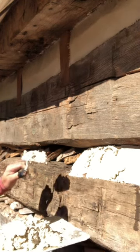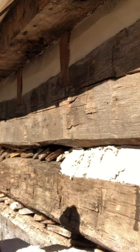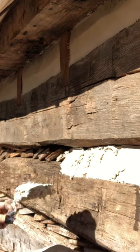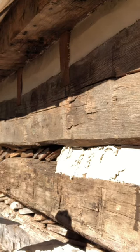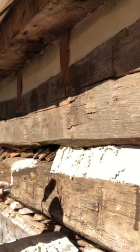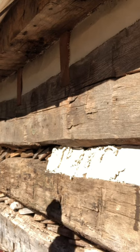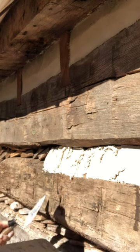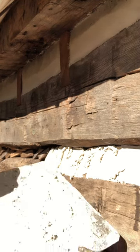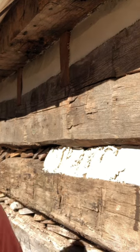So I showed you how to put mud this way and then double stack it. But another effective way, depending on the width of your joint, is to stack it in like that and run your point all the way up like this and stack them beside each other to overlap. And pull straight down. You're actually cleaning the bottom of your trowel off right on that leading edge. Then we'll stack across the top of it.